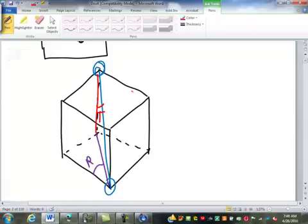Here, I think I've got a model back here somewhere. Look at that, right here. So here's your hole going in, here's your hole coming out, right? So you're sitting on the drill. So you're going to rotate it this way first so that this line here, the axis between holes, is perpendicular to the drill or the mill or whatever, right? So this is now lined up. Then you, what's that? Why does the rotation matter? Why does rotation matter? Because now when you tilt it, now this is straight above this.